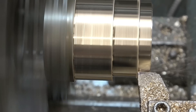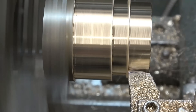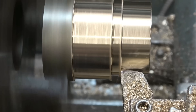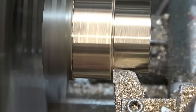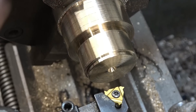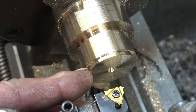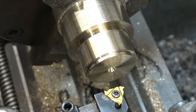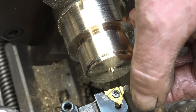Unfortunately the microphone decided to pick up the noise of the machine over my voice, so I want to do a little bit of voiceover on the next two or three clips in this video. I've got the piece of bar machined down now. The big diameter is actually the outside finished size of the thread, and the small diameter there is the actual core of the thread. I've also machined a groove in the back for the thread cutting tool to drop into.